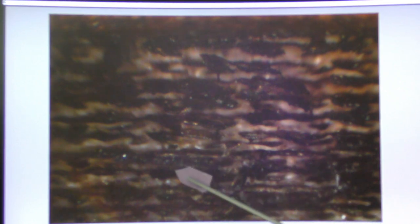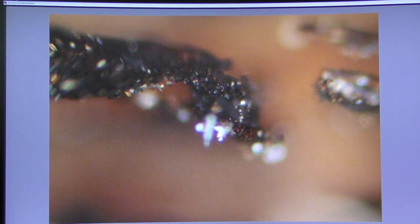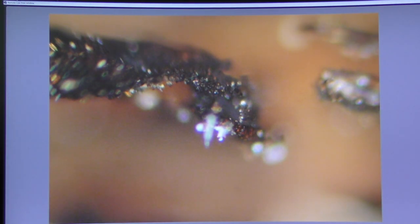It's almost like resinous material that's coming out of the wood. So let's move down to the most burnt. We can see the scan lines, and we can see all these little bright spots in here, which undoubtedly are reflections off of something which, as I said, looks like a resinous material. Let's just zoom in a little bit. Look at all those highlights, that crystal structure. So this colour that we're seeing is some complex chemical which is not carbon, but is like a burnt resin of some sort.